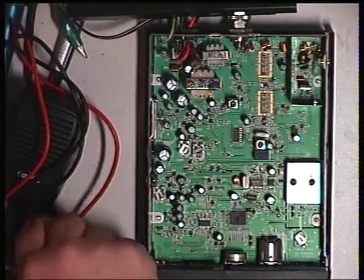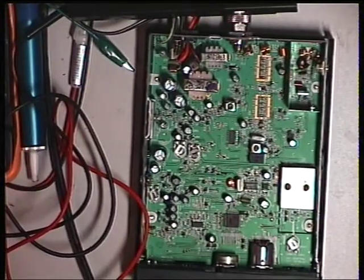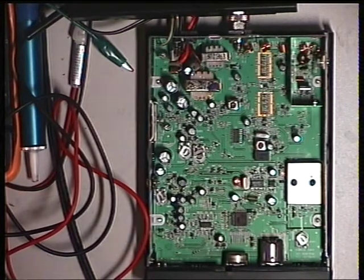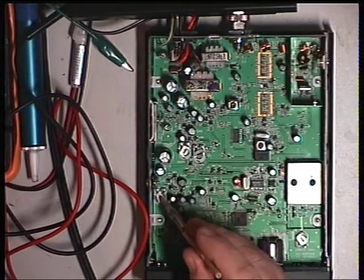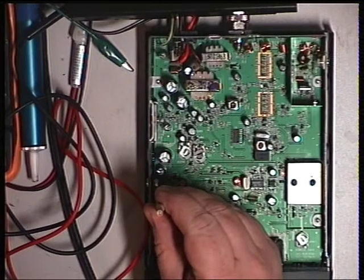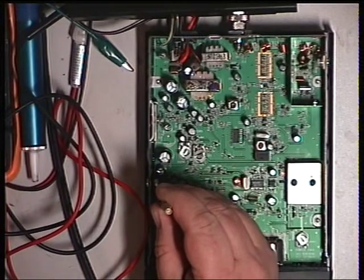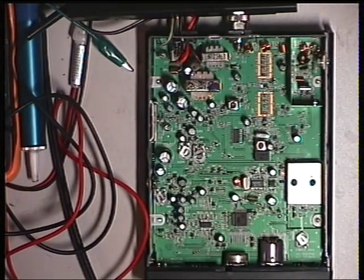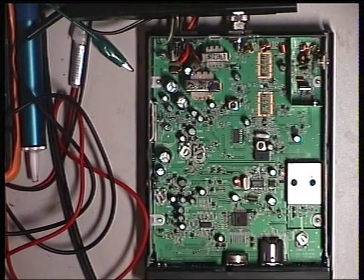The customer says optimise performance — well, there's nothing to adjust. So let's go into transmit. The first thing we'll do is make sure the power is 4 watts. It's reading 3.8 watts. V1 is the power adjust, and 4 watts is what it does into our test meter. Just looking at the power supply — it's drifted down to 13.6 — just do that test again. Yeah, we're spot on the 4 watts. That's fine.